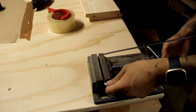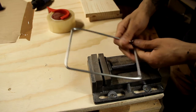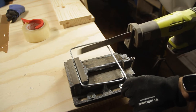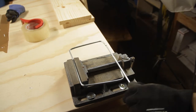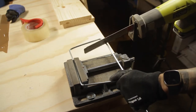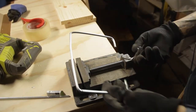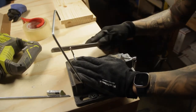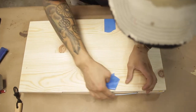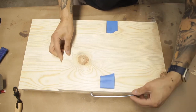Once you have that rectangle, you'll have to cut off the excess rod. An angle grinder would have been a lot easier, but I don't have one, so I used a reciprocating saw with a metal cutting blade. This was kind of disastrous because of all the vibration — I might grab an angle grinder or a Dremel with a cutoff wheel next time. The method still got the job done but there was so much vibration and it just didn't feel clean or safe. Then just take a file and smooth down those sharp edges. This came out a bit too long, so I ended up cutting off about a quarter inch on either side of the bar, re-bending everything, and that gave me a much better fit.